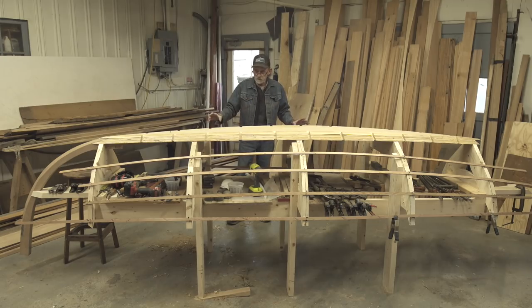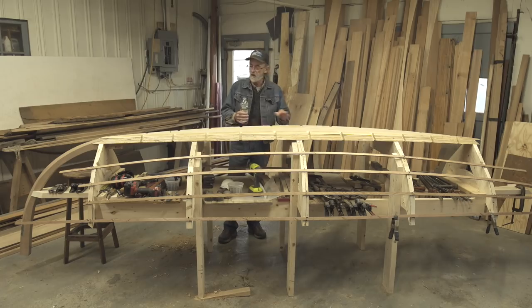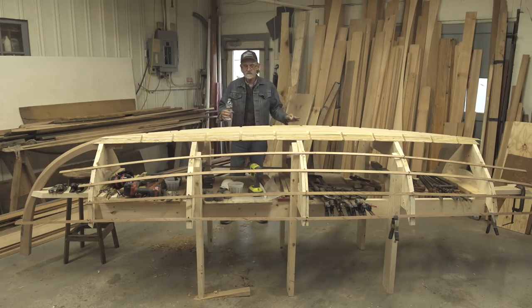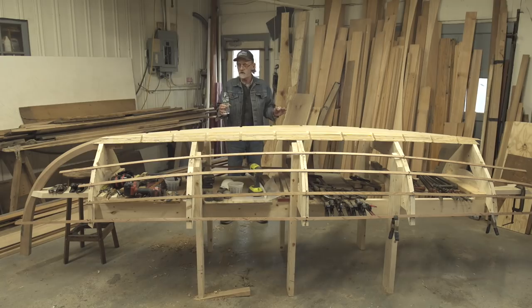The frames were cut from tree crooks, very accurately cut and beveled, and made up really in kit form. They were put onto large vessels, broken down, so that when dories were lost at sea they could assemble another dory on the deck of a boat. The planking was all cut out to shape, and it's taken people quite a number of years to come up with all those different shapes of the frames, planking, and stem. The stems were pre-bent, the transoms were pre-cut — all to facilitate easily putting a boat like this together on the deck of a ship.